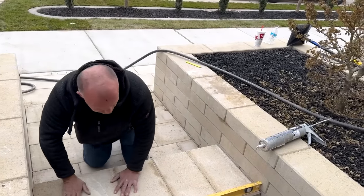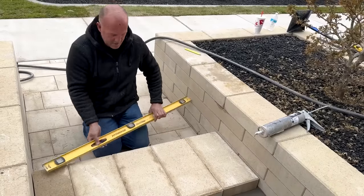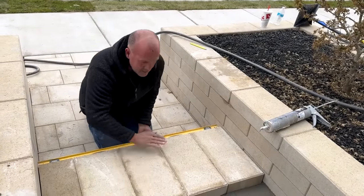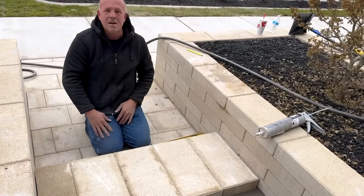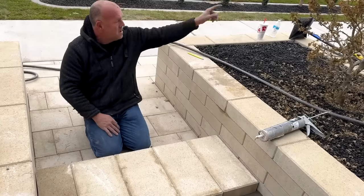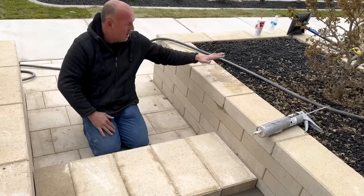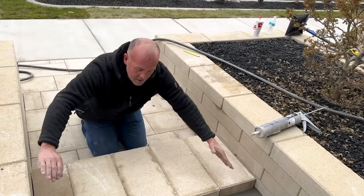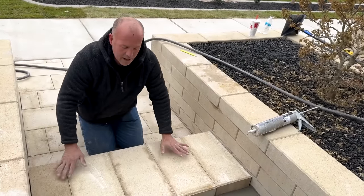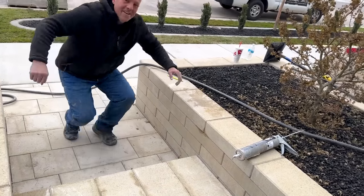This will set this way — check that way. Got a partial bubble coming this direction. The face is set. Absolutely no air pockets underneath this, no place for water to go. The glue joined at the front. I'm going to leave this for several hours, go do that side, then come back later when this sets up enough. I'll take another one of these stones, turn it this direction, fill it with concrete again all the way up to a half inch above that one to mirror what I did here, then set the next layer of stairs going back that direction. Back to work.